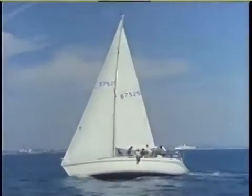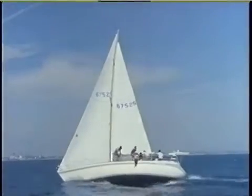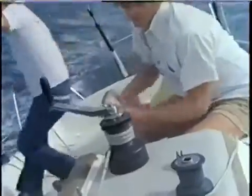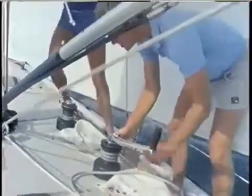You just saw a reef tucked in from start to finish, but here it is one more time. Let's look carefully at the gear needed to reef this quickly and go slowly through the reefing process. First, ease the sheet till the sail luffs, then lower the halyard to a predetermined mark. Take the time to mark your halyards for each reef point.